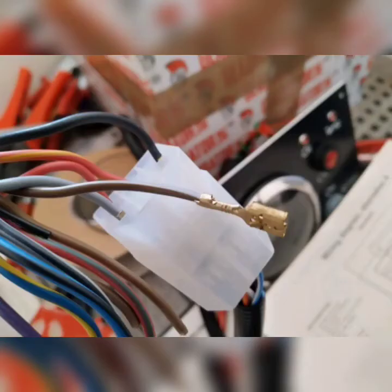Now the next wire, check the colour, look at the old wiring diagram, look at the new wiring diagram and connect the two together. As you can see, the Dragon Marine Systems female part of the multiplug and the male part of the multiplug are joined together. This is so I can marry up the wires between the two.